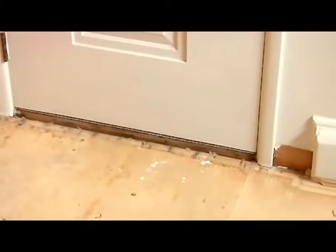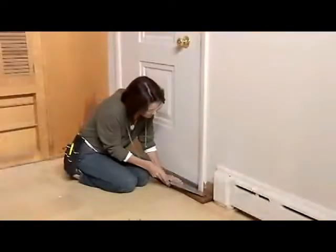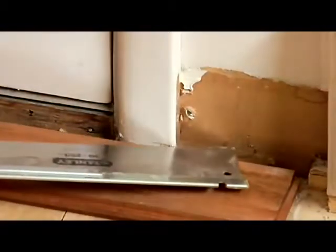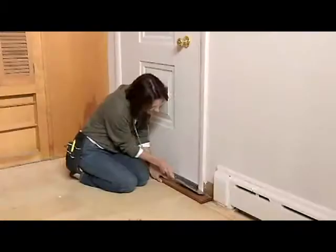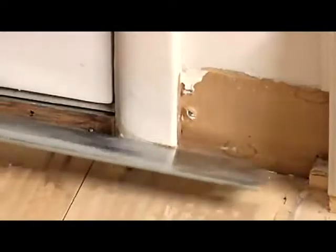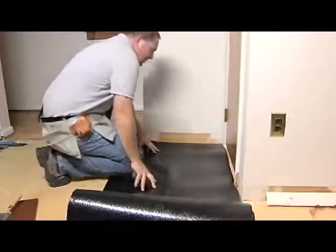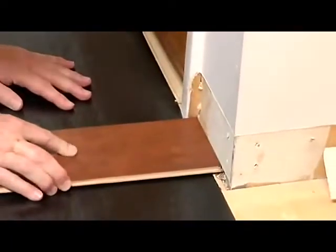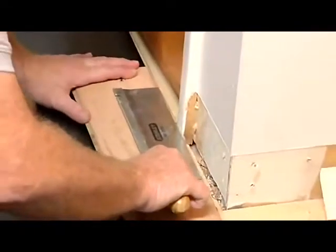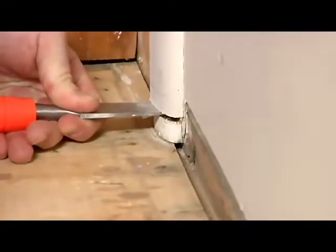Door jambs are another area where you'll have to do some undercutting. Most door jambs go all the way to the floor, so you'll have to undercut them so the wood will fit under. You can use either a power undercut saw or a manual jam saw. First, take a piece of the flooring you'll be installing and turn it face down next to the door jamb — this gives you the proper height and a stable platform for the saw. By turning the wood over, you can save the face and still use it for installation. If you're installing a floating hardwood floor, make sure to put a piece of underlayment under the flooring to get the proper height for your door undercut. Now get your saw and start cutting. You may need wood chisels to remove some of the wood.